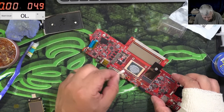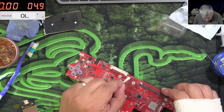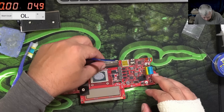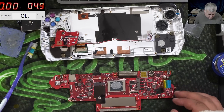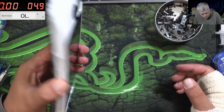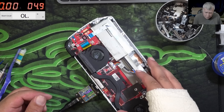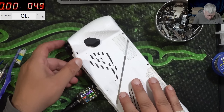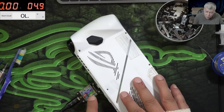Now let's be sure it's clean and nice. Need to be clean. Just give me a few minutes to put everything back together and do a final test. Everything is back in place. Let's plug the battery and plug the charger. Plugging in the charger and the meter is coming on — 19 volts. It's not charging without the back cover, so let me put the back cover on. Plug in the charger again, and yes it is charging — I can see the orange light, and check that it's taking current.